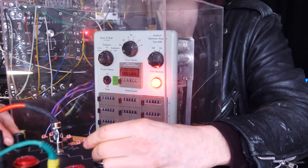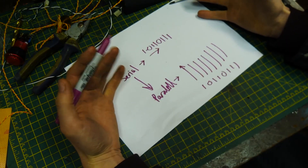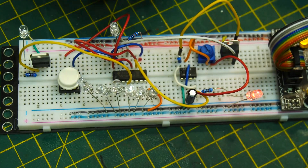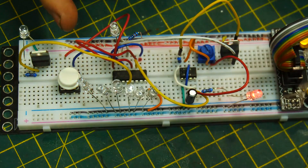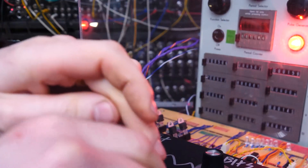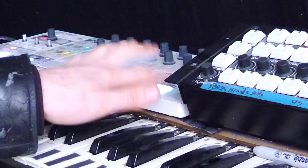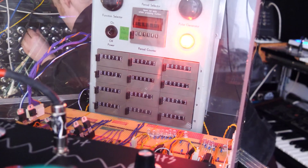The challenge is to trigger the 13 counters in a cascading pattern instead of all at once. There's no microcontroller — a serial to parallel shift register handles the triggering of each counter, and there's a 555 timer and potentiometer to set the clock speed. Once it's all assembled, there are different buttons to trigger all 13 clickers, a single click, or a short three-hit click. There's also an input jack so you can trigger it from other instruments or sequencers, and there's a contact microphone inside so you can further shape the voice.